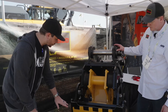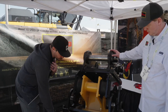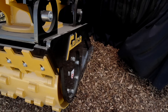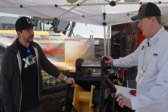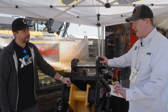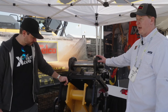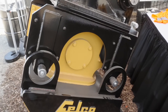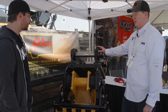The other thing we talked about was this low-profile tamp design. It's quite a bit different than the standard tamp design and layout. Our standard wheel compactors have about a four-inch tamping pad height and they work very well, but they do kind of chew up that top layer of soil where you're compacting. This product gets used in more of a finish situation where you want to have a finished grade on your compaction — it allows you to have bite on the soil to roll while not putting too much of an indentation in the top as you're rolling along.